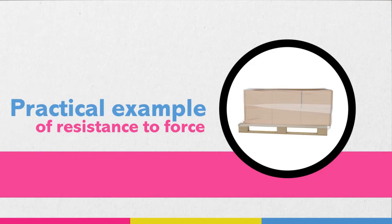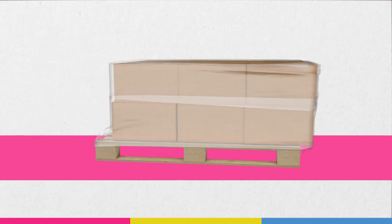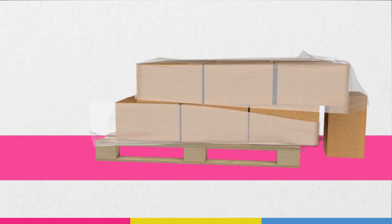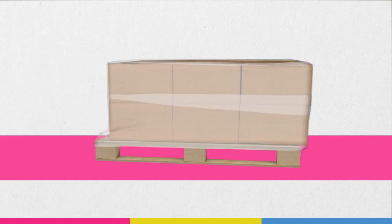Practical example. What happens to a film-wrapped pallet on a truck when the driver has to brake in an emergency? Low ability to absorb the forces in the case of standard film. The goods on the pallet slide out of position, ultimately tearing the film. Good ability to absorb the forces with pre-stretched film. The goods on the pallet only change position slightly and the stretch film stands up to the loads.